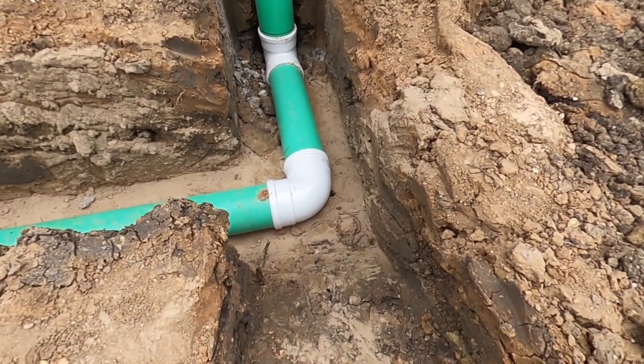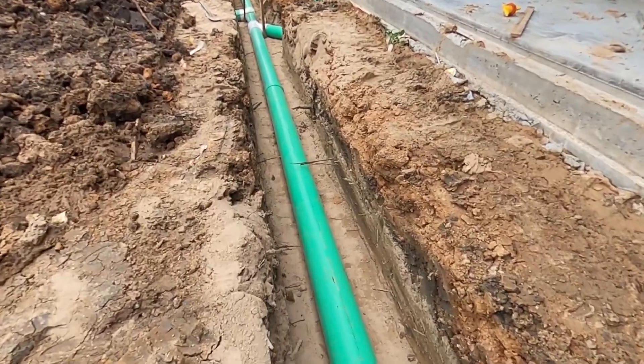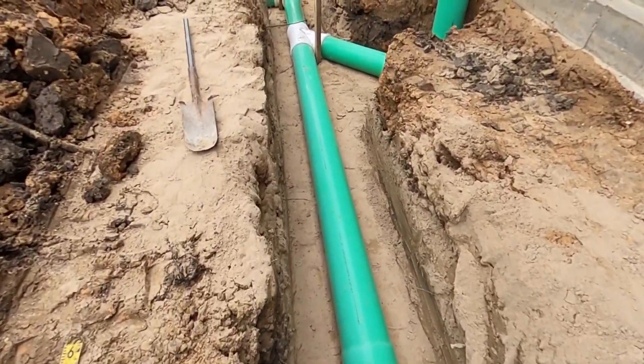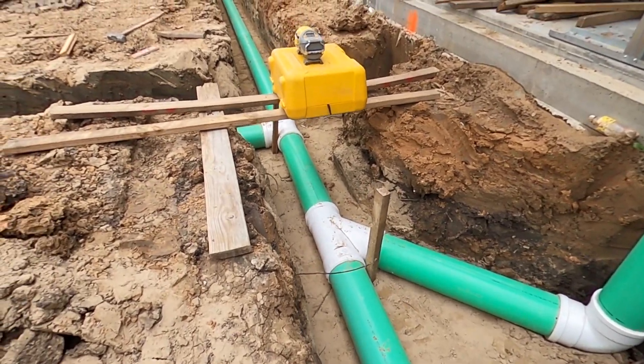You can see here we got some installed. Walk down the lane — look, all nice and neat. Now you want to turn the writing up. Make sure you turn the writing up, and a little bit later on we'll show you why that's really important. See, here's the next drain coming in — got the Y pointing in the right direction.